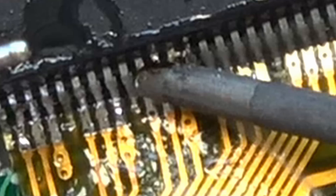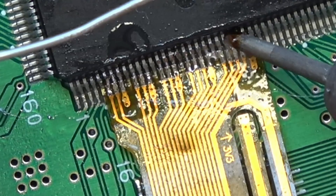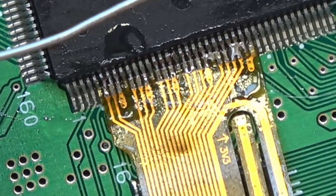If you're intermediate skill ability bordering on advanced, I'm pretty sure you can do this if you have some fine pitch soldering experience. If you don't, practice — take a fine pitch chip off of a dead board, remove it, solder it back on, do that a couple of times to get more acquainted with fine pitch, and you could very easily do this mod. It's not that hard, but there's a lot of techniques involved and it's very easy to bridge on this mod, so a lot of it is just removing your bridges, which can be easy if you've practiced and have the techniques down.